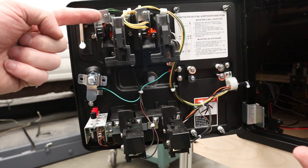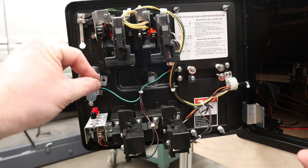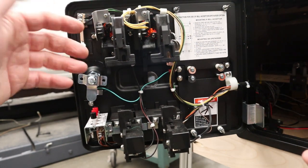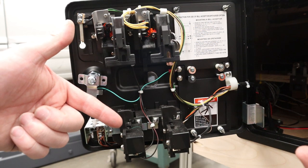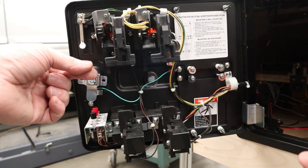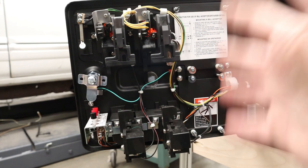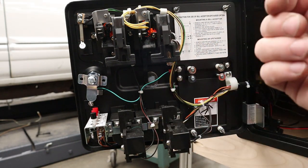Now, if in the wiring from the micro switch down to this micro switch, you put in a little toggle switch where you can break the connection for these up here, then you have a way where you can make it so that you have to put money in through your coin mechanism for this micro switch to register credits, and the coin return buttons won't work because that toggle switch is off. And to change that, all you gotta do is open up the coin door and flick a toggle switch. So I'm not gonna set that up, but I'm giving you that idea in case those of you that want to do that and you have coin mechanisms.